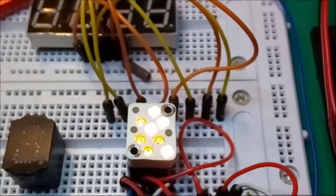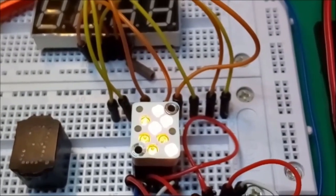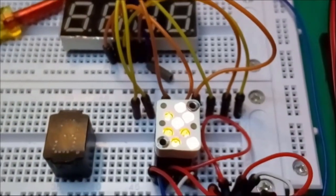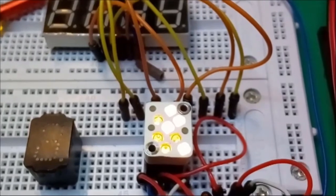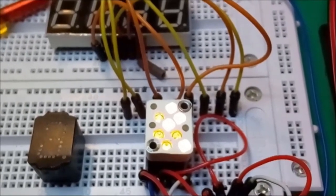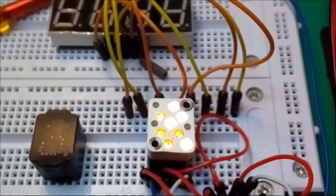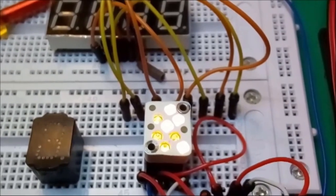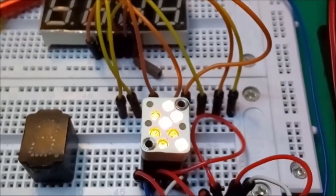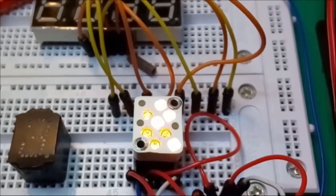And you'll notice that 4 of the light bulbs are rather dim, while 4 of them are a bit brighter, okay? And that's because the replacement light bulbs, which are the dimmer ones, require a slightly higher working voltage than the other 4, okay? So actually the replacement light bulbs need 6.2 volts, whereas the older light bulbs require far less voltage, in fact closer to 5 volts to be comparatively as bright as the replacement ones.